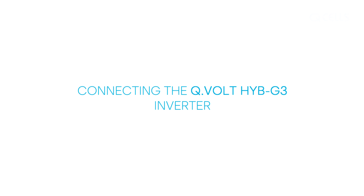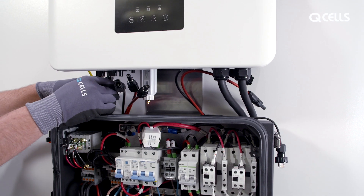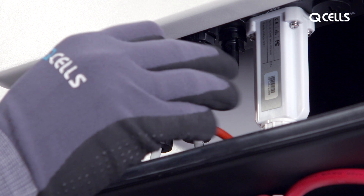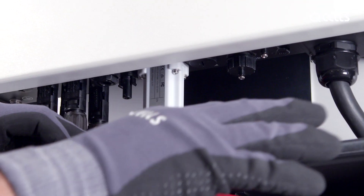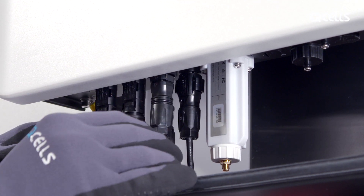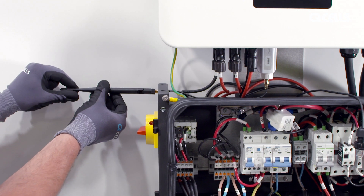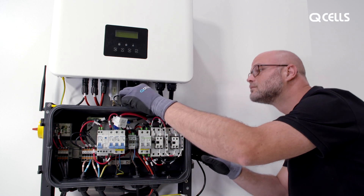Connecting the inverter. The negative photovoltaic cables from the MateBox are plugged into the rear connectors and the positive ones into the front connectors on the inverter. Also connect the battery cables from the MateBox to the respective plus and minus terminals. Screw the antenna cable from the MateBox to the WiFi dongle and attach the antenna to the side. Then connect the communication cable from the BMS to the inverter, as well as the communication cable from the MateBox.